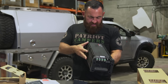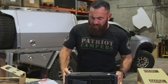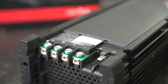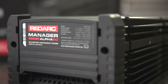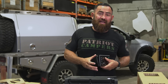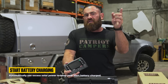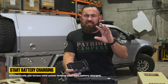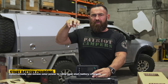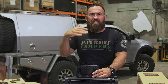There are a couple of RJ45 connections in there, and this is your input for your AC. A really smart feature these guys have developed is a smart charge mode for your start battery. You can wire the new Alpha directly to your start battery, and set it into a mode where, once your house battery gets topped up, it'll start sending 25 amps of solar power directly to your start battery to keep it topped up.